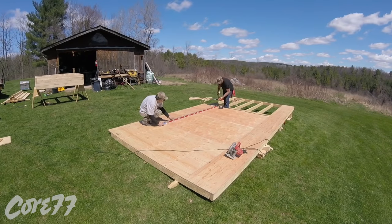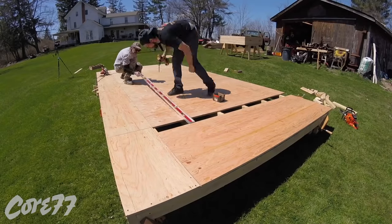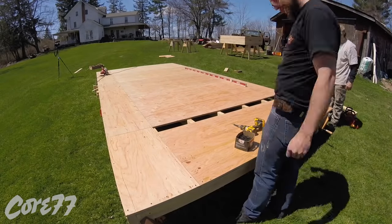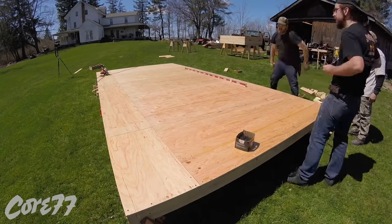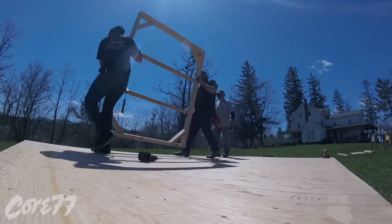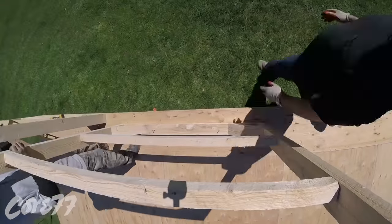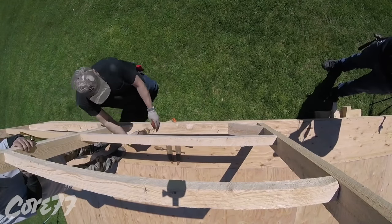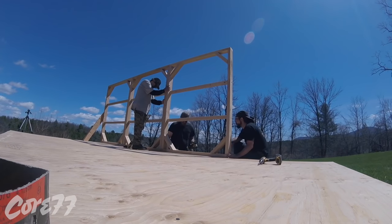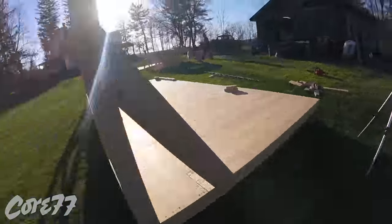There's me and Willie and Dave laying out the flooring, just waiting so I could then put the wall up. We worked as a really good team. We laid the flooring just across the 3 sections and we didn't cut it yet — I figured we'd cut it once we dismantled it, so the thing would stay together nice and strong while we worked on it. You can see it's leveled in my backyard, all cantilevered up in the air. We shored it up more, with clamps holding 2x4s and piles of wood under the corners. Now these are 2 of the 4 back wall sections, and those corner braces are where all the strength is derived from.